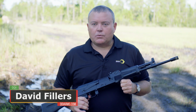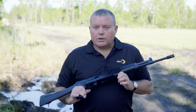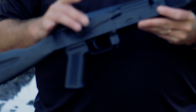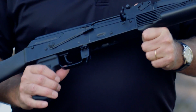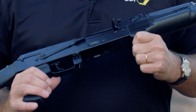We're down here at Big 3 showcasing our US AKs, our US Kalashnikovs. We've done what no other AK manufacturer in the United States has done to date. We have a hammer forged bolt, hammer forged bolt carrier, and hammer forged front trunnion. These are done the way they were meant to be. This is one of the first models we're producing. We'll be building those fairly soon.